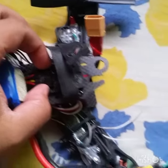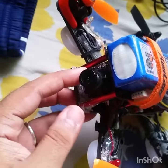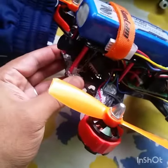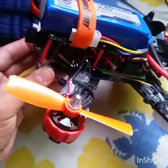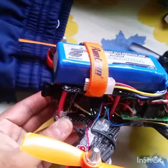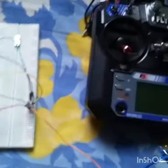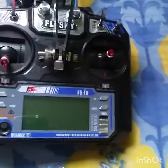One power is for the camera and one for the TX. The FPV camera has a JST plug on the back — you can barely see it — and it has a power, video, and ground output.